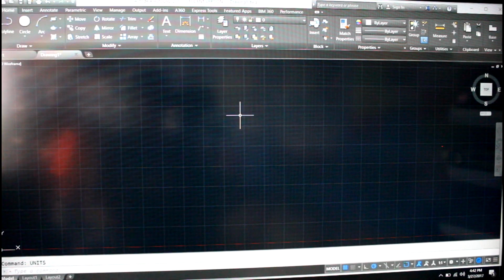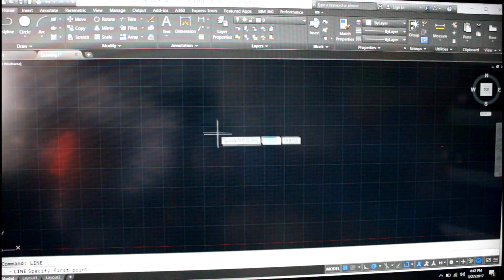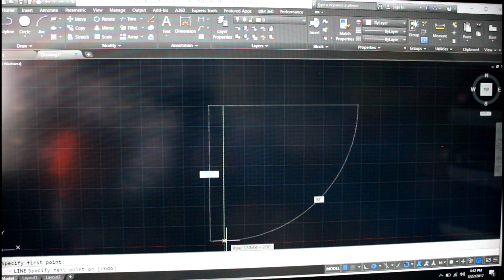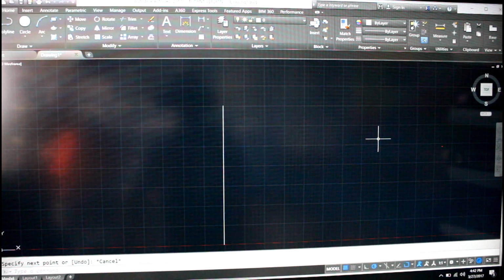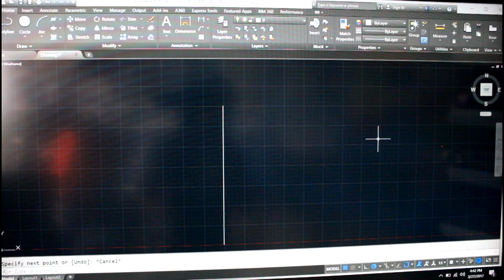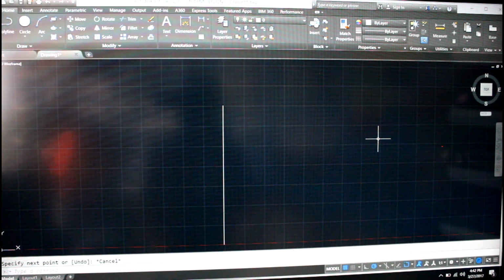Okay, so without making this too repetitive, basically what I'm going to start by doing is lay down a center point line, which will be the line which I revolve everything around for the project. This line doesn't have to be any specific length. It should be a little bit longer than your frame and everything total. You can delete it later when you're finished, but this will allow you to have a center that you can use to reference when making all of the different components. It'll just make your life a lot easier.